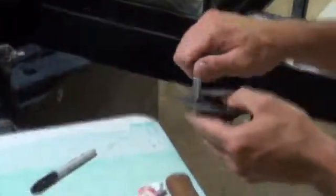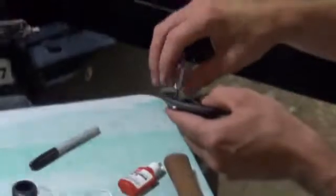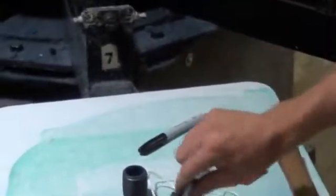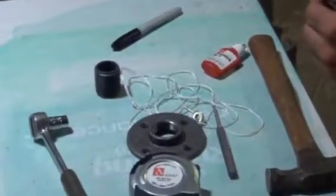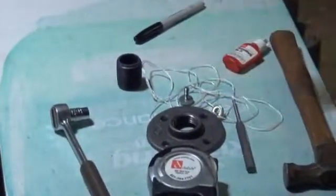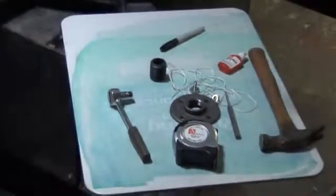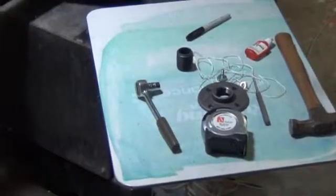The reason we highly recommend metal anchors is they won't give. It's not that the laser is very heavy, it's that you have that leverage with the longer pipe, depending upon how tall your ceiling is, that it could be worked loose. Now that's as far as it goes with putting the anchors in.